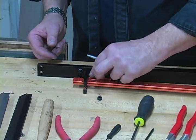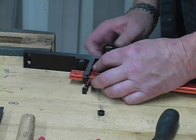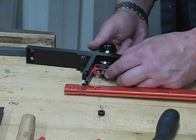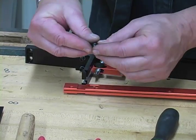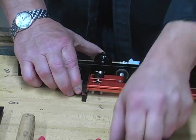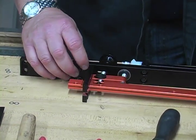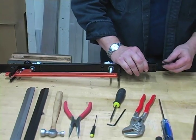The next thing I'm going to attach is the adjuster mechanism. I have a barrel nut right here — I'm going to slide that into this hole. I'd like the smooth shank to protrude clean past the top of the barrel nut housing. Then I'll take the depth adjuster, pinch this together so that the depth adjuster is pushed all the way down, and lock that. Now my depth adjust mechanism works.